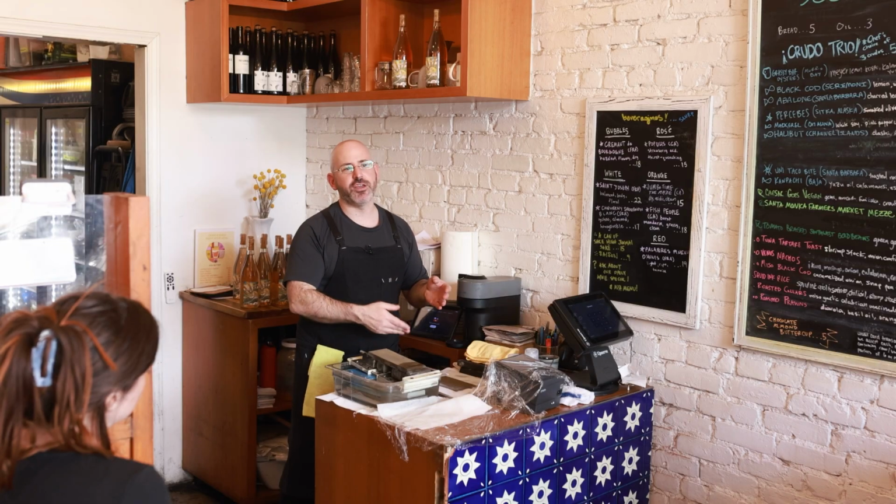And if you do ever want to dry it, you have to slow down the drying process, because when it dries out, the outside loses water more quickly than the inside, and it contracts around the center that's still flush with water, and stress fractures form. Resinoid-based stones are really cool because they provide the highest level of polish and the most smooth, even-looking finishes, and they provide a really creamy, almost luxurious sharpening experience. It's a really smooth, fun experience.